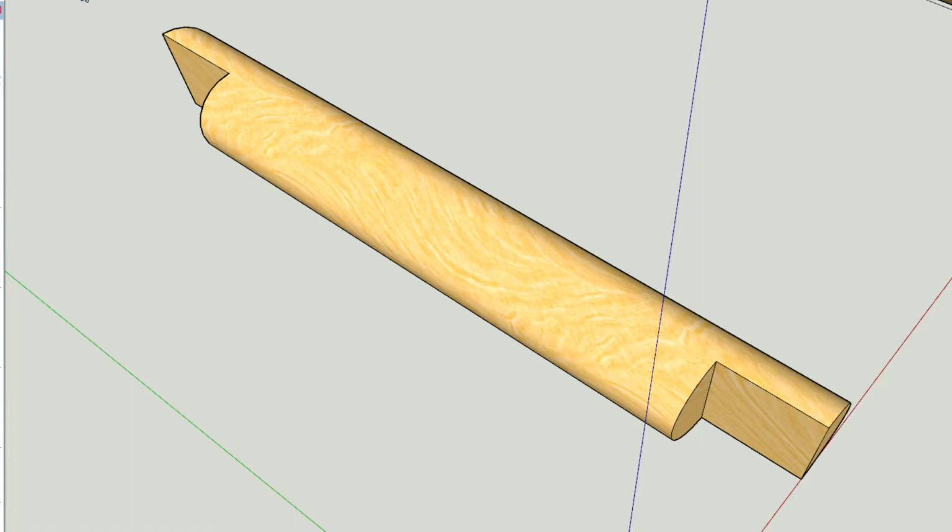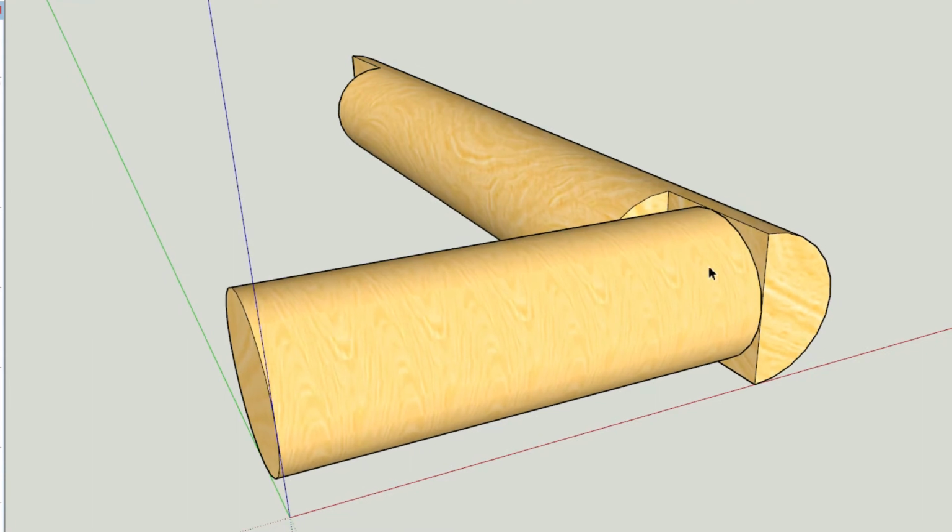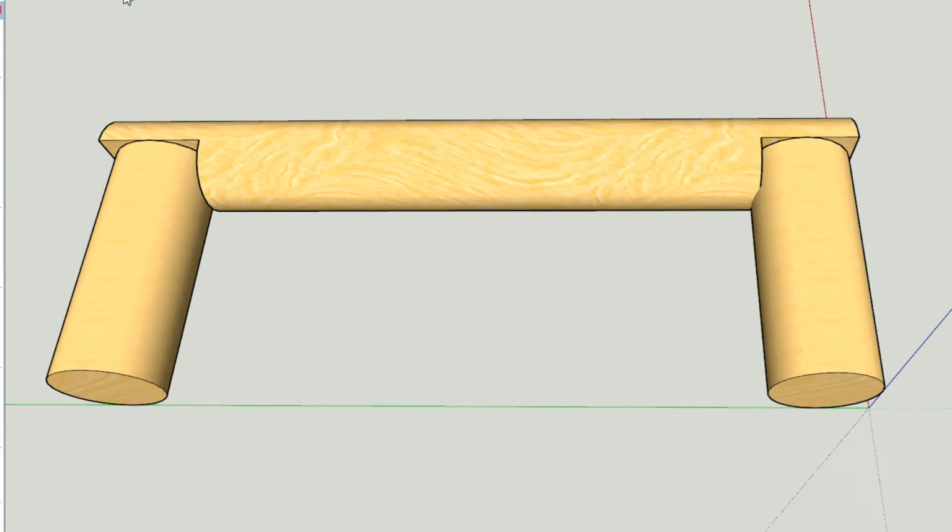So first thing you're going to do is attach this front piece here. Obviously we're using the coach screws from the side through into this round piece of timber just here. Depending on what screws you're using, you might need to do a pilot hole if you don't want to split the wood, but hopefully you'll be okay if you've got some with a thread.